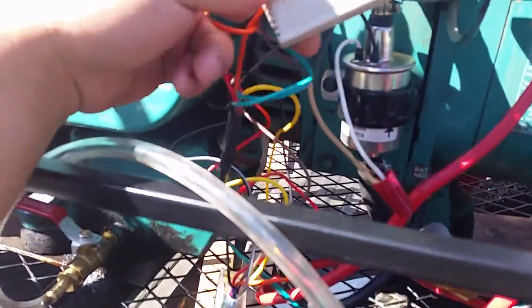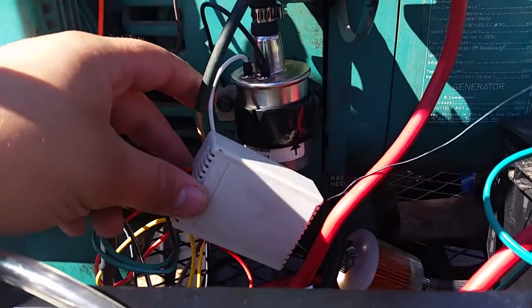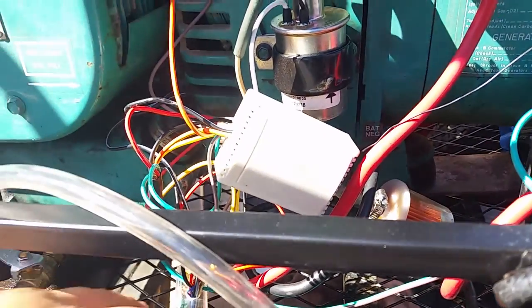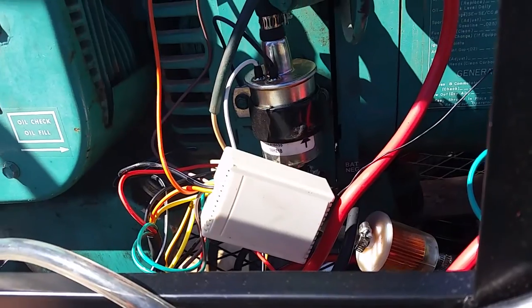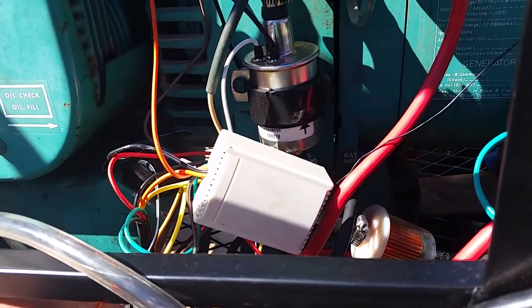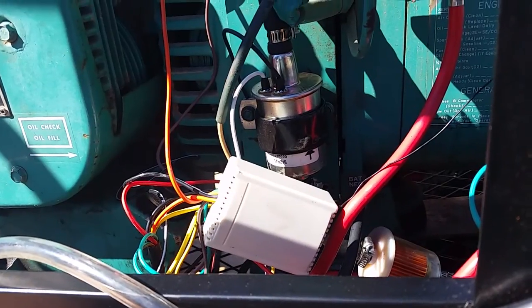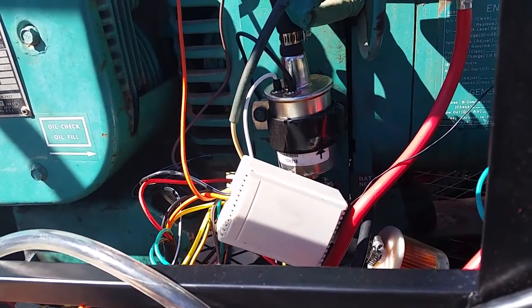I use a receiver for the little transmitter. Like I said, it's a two-channel, but I'm only using one channel. When the relay switches to the off position, the normally closed contact shorts ground to pin two, which kills the engine if it was running.